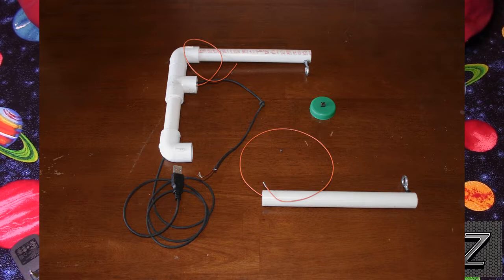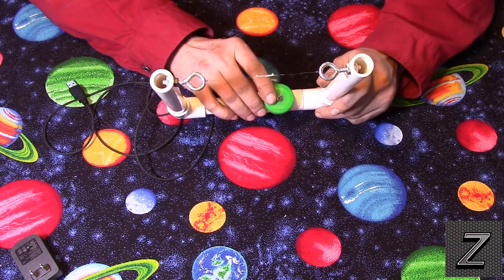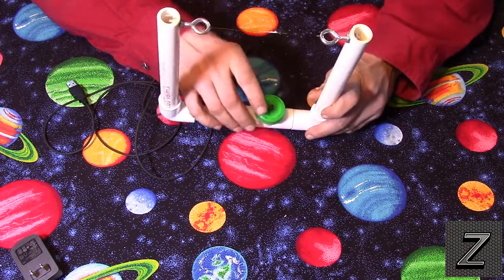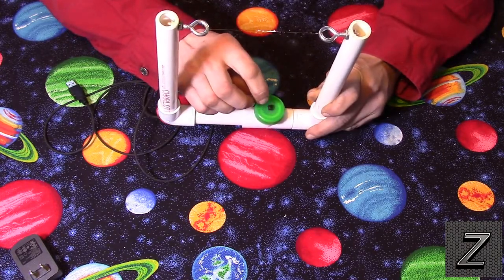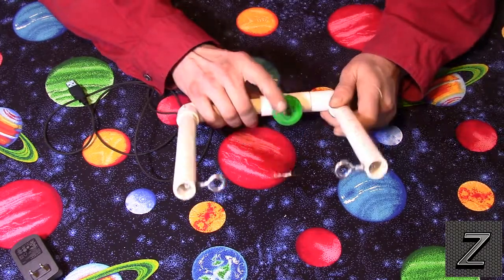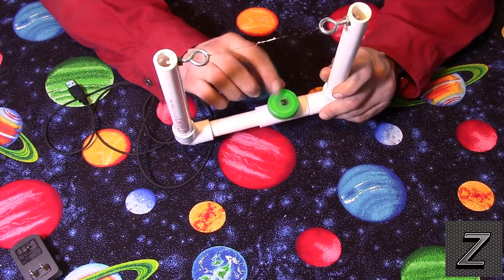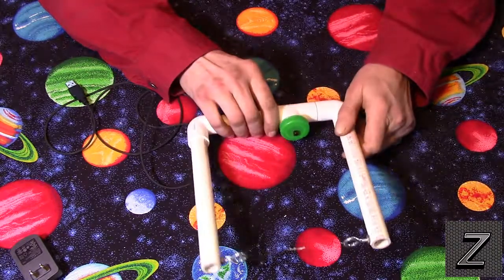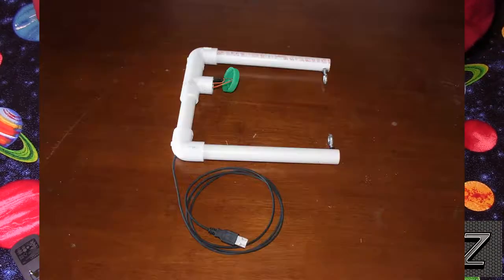Now to attach the push button, it has 4 pins on it that come out the bottom, and I cut off the two of them that I didn't need, just kept the 2 that make contact when you push the button. Then I took a sewing needle and placed the push button on top of it, held it centered, and pushed the sewing needle through where the 2 pins on the back side of the push button switch are, to fit it through the milk cap. And then I put a little drop of hot glue on the back of the button, pushed it down and held it for a few moments until it cooled off and held. And of course I soldered my wires on the back side. Once again, here's a picture of what some of that looks like on the inside.